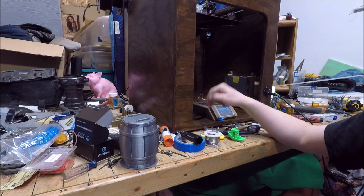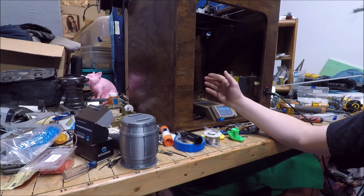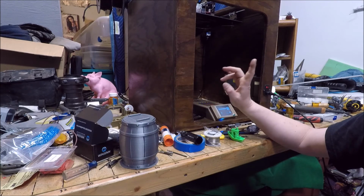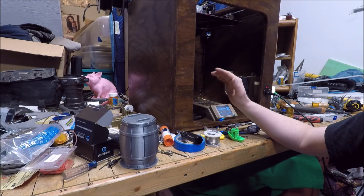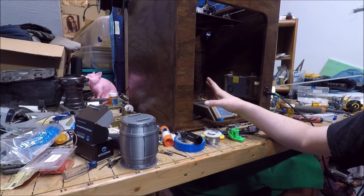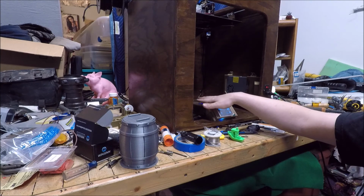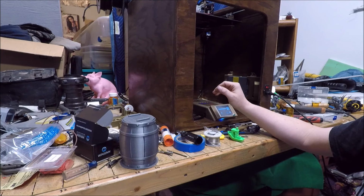And basically, you could run this printer off of very default settings in the slicer. The only thing that I really changed was I bumped up the amount that it feeds out when it first starts up. I find that works a little more consistently. I also told it to, when it finishes the print, home the bed back down, which is just a few keystrokes in the G-code.